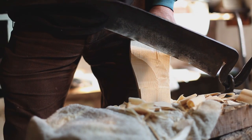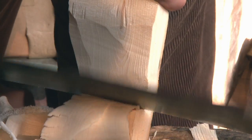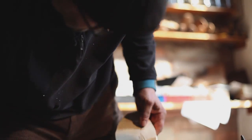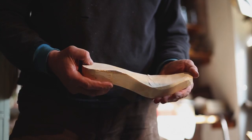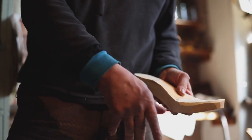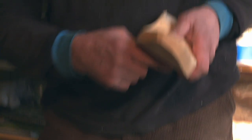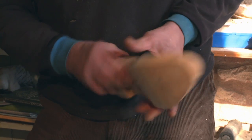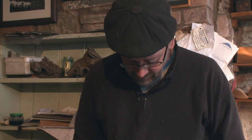So you cut back into here, and you have to make this curve slightly concave or straight. If you make it convex, it looks lumpen — see, that's a lump there, not good. So it's better that way. You tend to do it in a pair, so I take that one down to the same as this one. When I've got them both with the same roll — the curve starting in the same place, the arch and the step the same, the heel roughly the same — a mirror image in fact — then you can do a bit more.